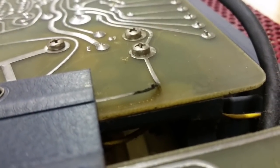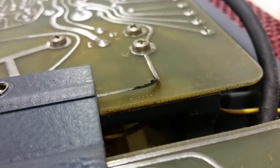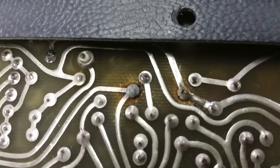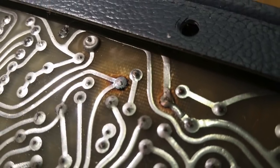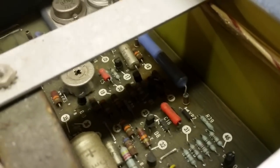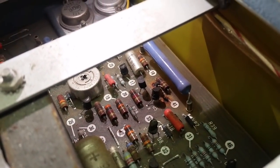Focus, you piece of shit phone. Yeah, look at that. Well, that's your problem right there. That trace was actually not the problem though — it had lifted off the board, it still had continuity. After I poked around in the power supply some more, I found a diode that had gotten so hot that it had discolored the board. There's a bad diode under there. We're going to try replacing it and see what happens.